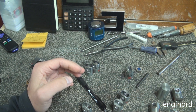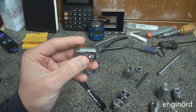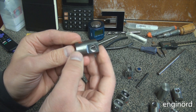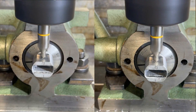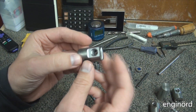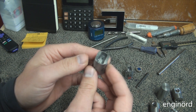I'm learning from the previous operation where the tappet was held in a collet chuck only in a small area. You can see when the drill is acting on it, this thing is bowing down, bending down in the collet chuck. So I wanted to have a little bit stiffer work holding in this case.